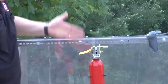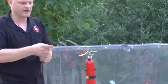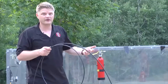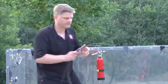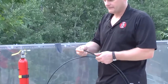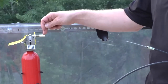Now that we've got everything in place, the next thing we're going to do is put in the manual release pull cable. What's nice about the stop-fire automatic unit is not only will it work when it gets to a certain temperature, but you can manually release it if you notice the fire before it's gotten hot enough for the unit to actually go off. Mounting it is very straightforward — you've got the wire portion and the brass portion. Make sure that it goes all the way into the manual release pull cable coupling right here.